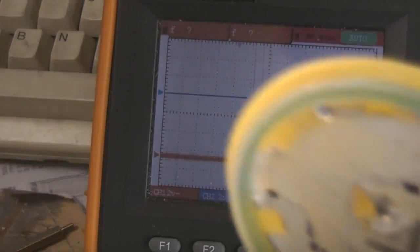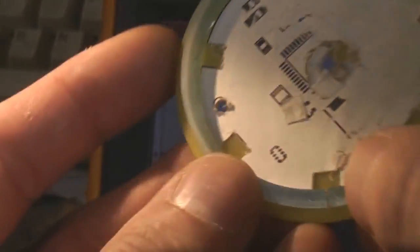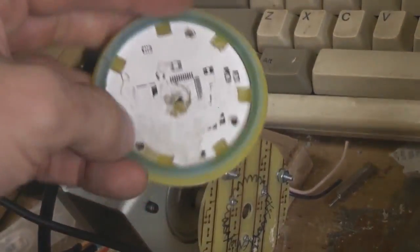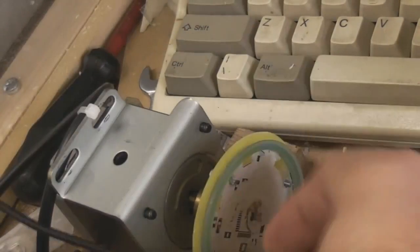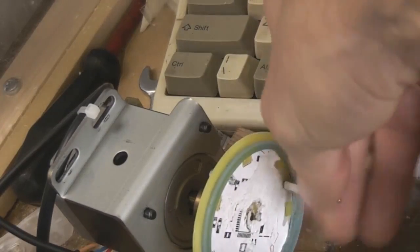This is the coil I'm winding. Basically the circuitry goes in the middle of the PCB, then there's this bobbin — this one is acrylic but it will just be made out of 3.2mm PCB material glued on the outside — and the coil will be wound around the outside. There's a little slit cut there and the two ends will solder straight down into the PCB. The winding jig is just a plate with some screws, so the bobbin just locates onto the screws and is held in place with a couple of pillars while it's being wound.